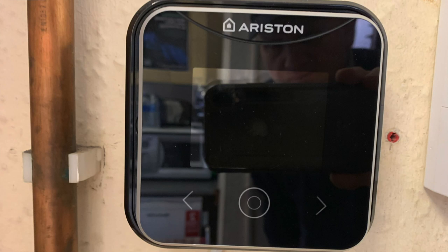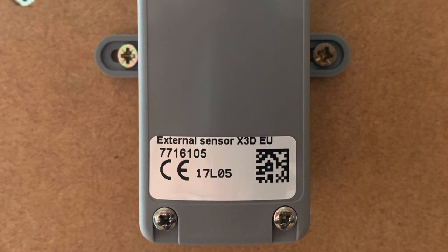Let's have a quick look at controls. Because of Boiler Plus, we have to make sure our stat is Boiler Plus compatible. Every combi boiler needs a room stat and a time clock — however you do that, I would always advise using the manufacturer's controls because they will make the boiler work at its optimum. The two boilers I've got here: one's working off an internet control, and the other is working off an RF room stat with weather compensation. Always fit controls to Boiler Plus, and always try to fit the manufacturer's controls — it'll make installation easier and the boiler will work a lot better.